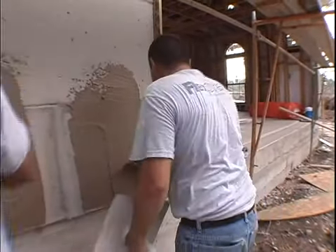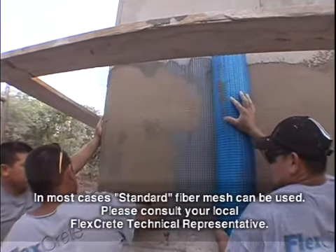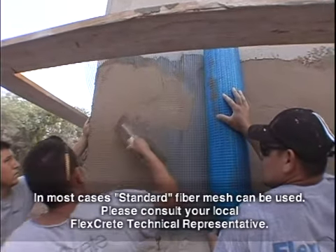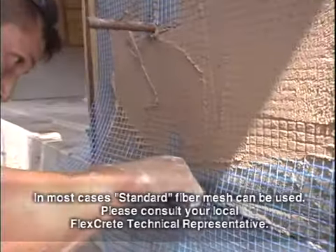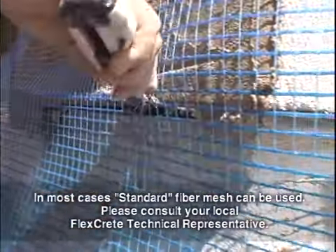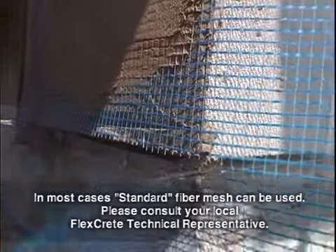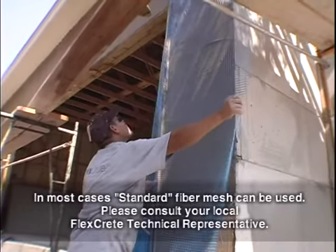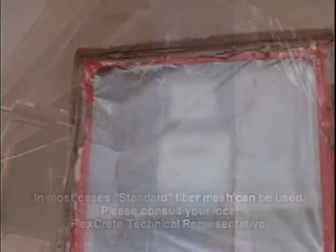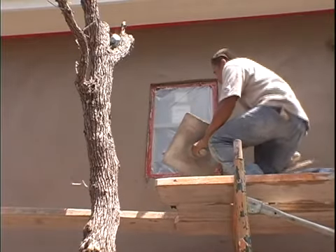Begin applying the base coat material generously to the wet cladding panels. Once a layer of stucco has been applied, a mesh will need to be applied and will serve as a stabilizing underlayment to the mortar. Be sure to properly remove all excess mesh with a razor. When applying the mesh, be sure to carefully cut around all plumbing, electrical, or mechanical stub outs, and use detail mesh around windows and doors. In all cases, follow the manufacturer's instructions printed on the bag or bucket of the product you selected.